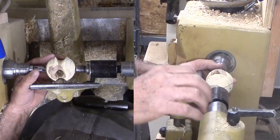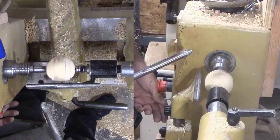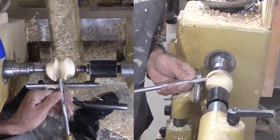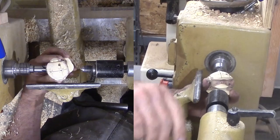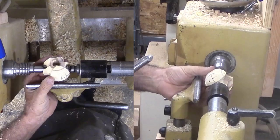Next, rotate the sphere to the next set of index marks. Mark the cove edge lines, cut the flat, and cut the cove. This is a great time to practice starting the cut with the gouge closed, meaning the cutting tip is vertical. Otherwise, especially with the intermittent cuts, the gouge will skate, giving nasty threads. You may note that I forgot to drill before the cove and have to estimate where it should be. Again, practicing good tool control pays off to get clean cuts without skate threads.